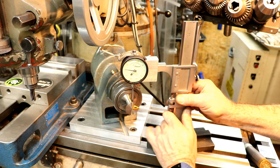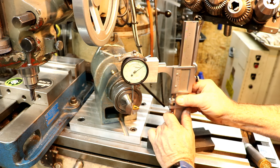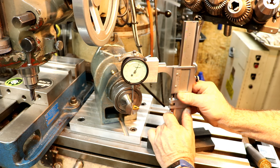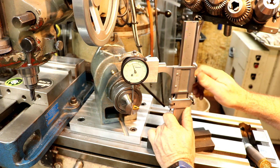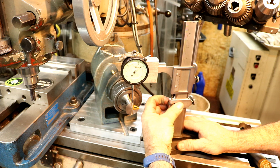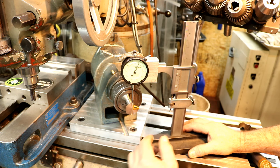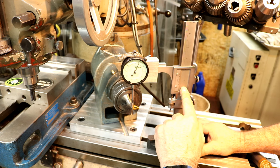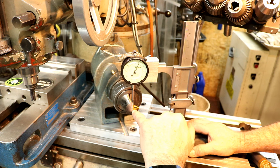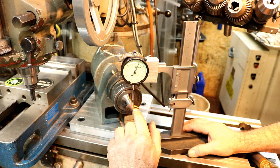Here's the plan: I'll set this at zero on the highest point of the gauge. It gives me a fine adjustment here and I'll dial it in to zero. I'll read the vernier and calculate the mill depth. In this case I'm going to calculate half the depth, because that's where the cutting edge should be — right at centerline.